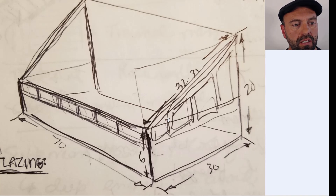We've got a sloped roof that looks like it's anywhere between a 4/12 to 6/12 pitch. So if they're in a high snow load environment this roof should shed snow, especially if there's going to be some internal heat. Typically the slope of a greenhouse is dictated by your snow load, especially if you're going to be using a polycarbonate glazing.